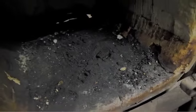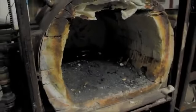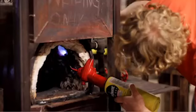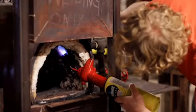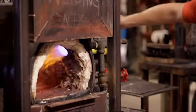It's the oven that cooks the metal to over 2000 degrees Fahrenheit and breaks down the crystal structure of the steel. The basic structure consists of a cast iron pipe with holes punched into it. This allows natural gas and air to pass through, which ignite the intense flames from within. As the flames shoot out of the holes, they bounce against and around the interior walls like a vortex, which minimizes heat loss. It is also lined with castable refractory, a material similar to cement, which is very good at holding heat. This is displayed by the orange glow, its incandescent color.